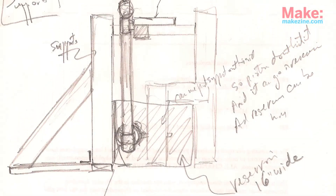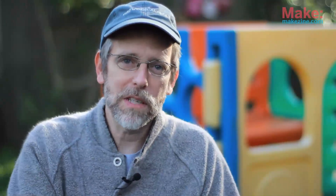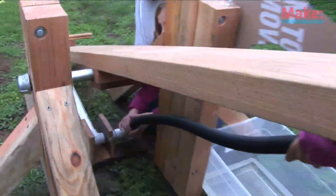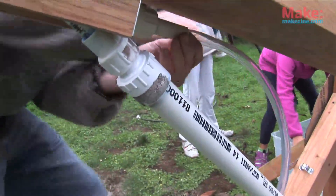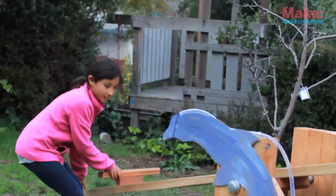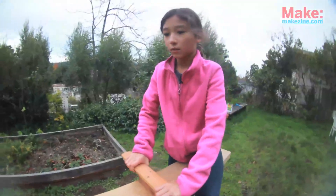In my earlier designs I always expected the bottom of the piston to be in the reservoir, but when we realized that wasn't going to work, the reservoir was separate and there was a tube going from the bottom of the piston up over the lip to the reservoir. We got that set up and started pumping and nothing happened — a lot of funny noises, no water. Then I thought about it and realized I needed to prime the pump, just like in old style pumps.